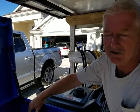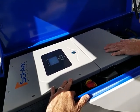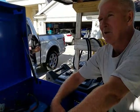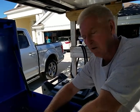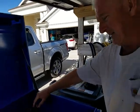Is IP an acronym for something worth knowing? Different enclosure specifications, just like you have in electrical systems. You may have a NEMA 3R enclosure, which is what this enclosure is, which is rated for outdoors. You wouldn't want to spray it with a pressure washer. And the IP, similar to the NEMA codes, I can't even remember what it stands for, they're waterproofing ratings. So there's IP67, there's IP68. It's just a matter of looking it up and seeing if it's suitable for the intended purpose. And intended purpose is not what it stands for. It just happened to be accidental.